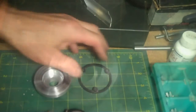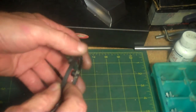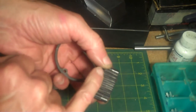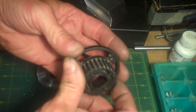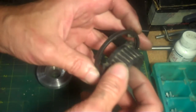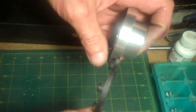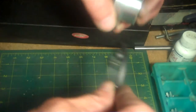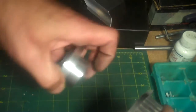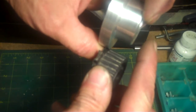Okay, I'm going to explain a little bit of what I'm doing here to verify that I got the proper dimensions now. To verify that I have everything properly machined, first of all, I need to look at this and say, okay, this flange here is the exact same thing as this flange here, because this sits inside here flush, so that both parts of the flange are together as one unit. This is the same as this. With that being the case, I take the workpiece from the feet to the front, and that's the same size. That means the top of this is the top of this right here.